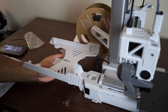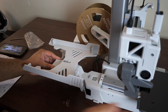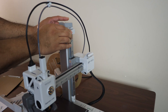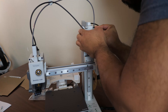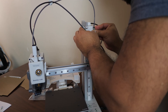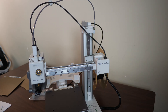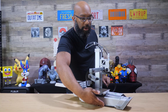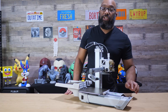You also have the lifter, which goes right up on top. Then you have to relocate where you put the filament in — usually it's on the side of the motor, but you take that part out and plug it into another slot right here on the lifter. There is also a black cable that runs from the lifter; it can go underneath the printer or on the side, and it connects to the ejector.